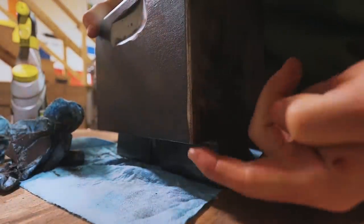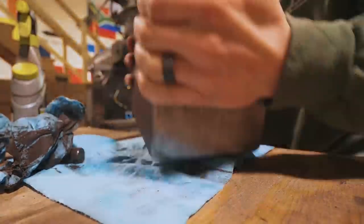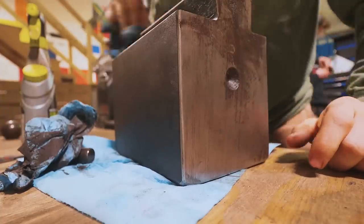Key things here: as I resurface this, I need it to be as flat, square, and true as possible to how it's going to sit in the actual machine. I should have looked at whether we're contacting on the bottom of the dovetail or the side of the dovetail. My guess is we're contacting at the bottom as opposed to up here. We'll flip it over and have a look at it to find out otherwise.